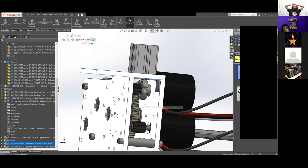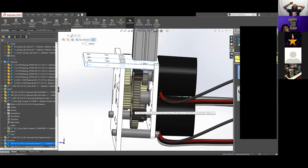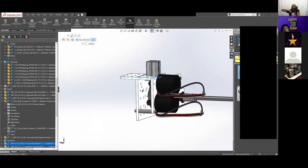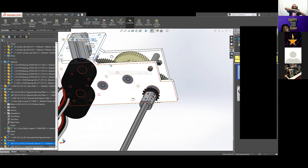And we wanted this as far up in our gearing as possible, so we get as much force on it as we can. Right. So trying to grab and stop that pinion from moving, you need a lot less force than if you're trying to stop that hex shaft at the front from moving, right? Because any force that you put down at that pinion is getting amplified. Any torque that you're putting there is getting amplified by all your gear reduction going up to that hex shaft. So it's a lot easier to stop it back there than anywhere else along the chain, right?